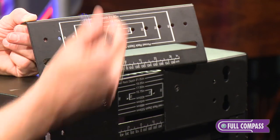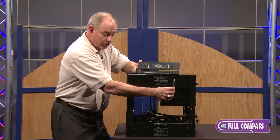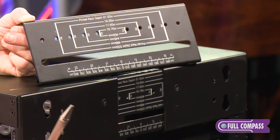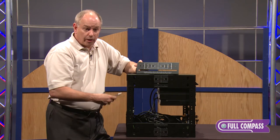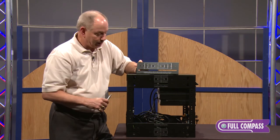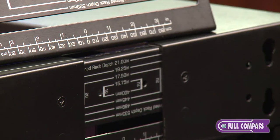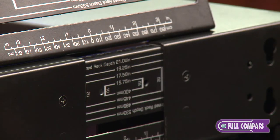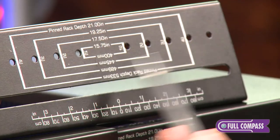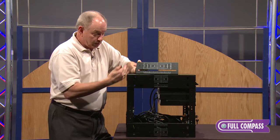With this minor adjustment, you would not be able to use the pinning screw. This makes for easier assembly if you leave the front fixed, since weight bias is typically toward the front of the rack. Should you load your equipment and then decide to make a variation, you would want to use a ratcheting box-end wrench, readily available at retailers and hardware suppliers, making it a simple tweaking job. For fixed-point depth settings, the fixing screws are located here in the hole set. This unit is open to 2U — there's 1U, 2U, 3U, 4U. At 4U in this model, you're at 21 inches deep, which supports the side panels and other accessories.